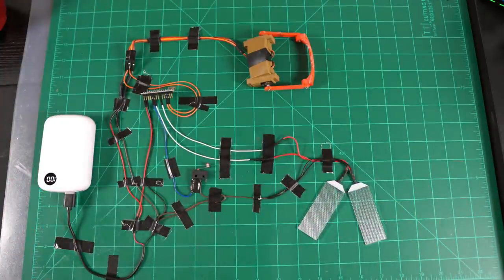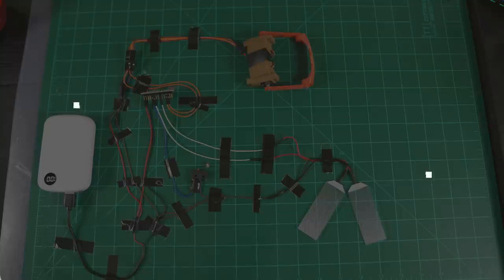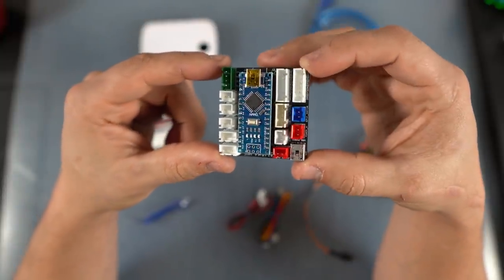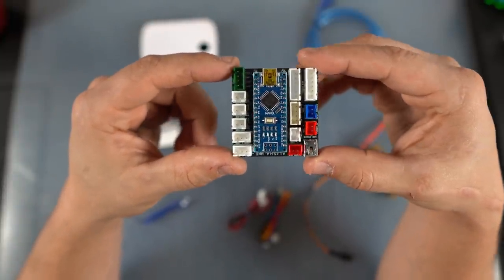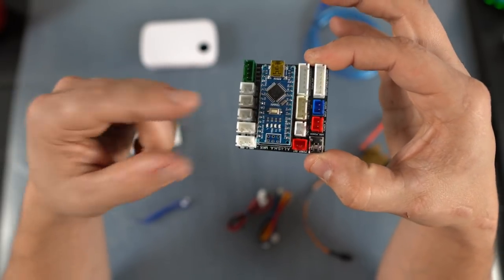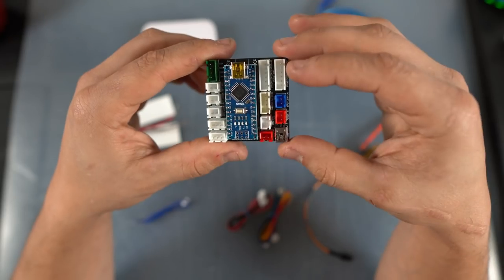Final recap of the wiring: positive and negative come from the USB pack all the way up to VIN and GND on the board. Coming out of that, the LED eye positives go through white wires. All grounds — the trigger, the LED eyes, and the servos — are connected together. The servos get power directly from the battery pack, sharing the same positive and negative. The orange wires from the board going to pins D9 and D10 are the servo control wires. Now it's time to talk about the thing I've been most excited about for this whole video — the Alicia board by Crashworks 3D.